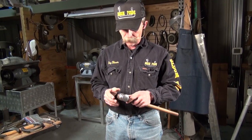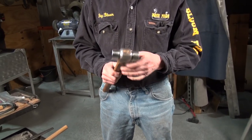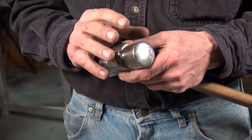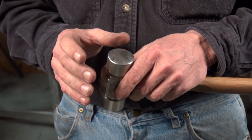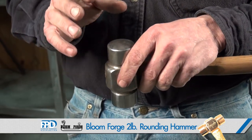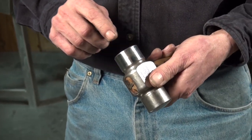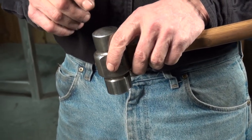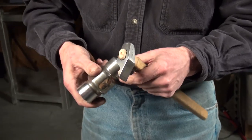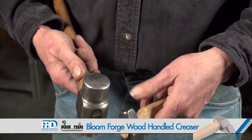Let's talk about hammers. The hammer itself cannot be harder than the tools you're going to strike. There's a balance in the Rockwell hardness of the hammer that needs to be maintained — it's around 54 Rockwell, with a hammer made out of 4140. I don't want any impressions made in the hammer. If I do get an impression, my tools are probably too hard or my hammer is a little soft. But if I can attain that 54 Rockwell, it should hold no matter what I'm striking.